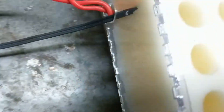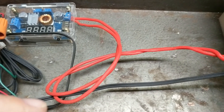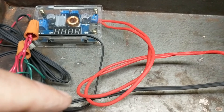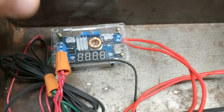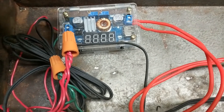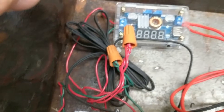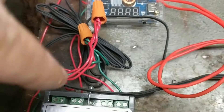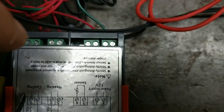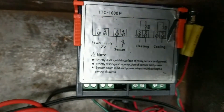Here's the important part: that heating pad, while it's rated for 12 volts, it'll pull as much amperage as it can get, so all you're going to do is pop fuses. This little guy right here is what's called a buck converter. The power comes directly out and into that buck, then crosses back over to this controller. I'm not going to go through the wiring because the wiring is a little bit different on these different models — there's the wiring diagram on mine and there's how the wires go in.